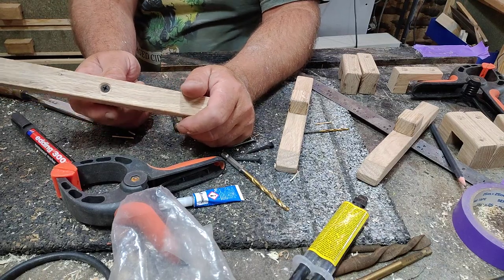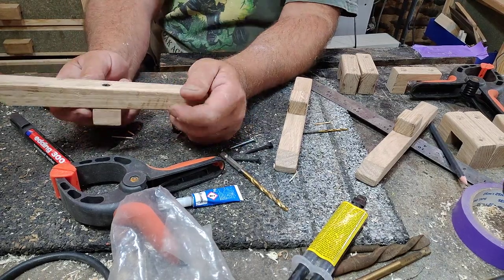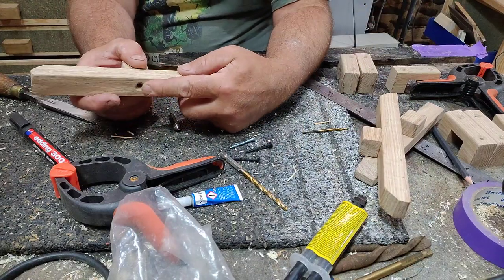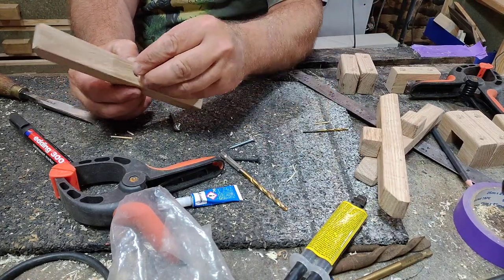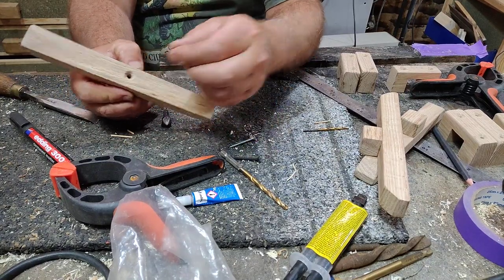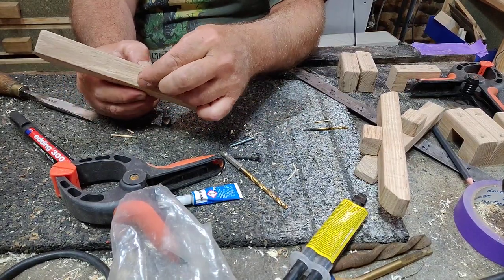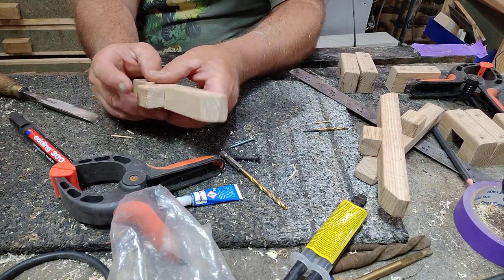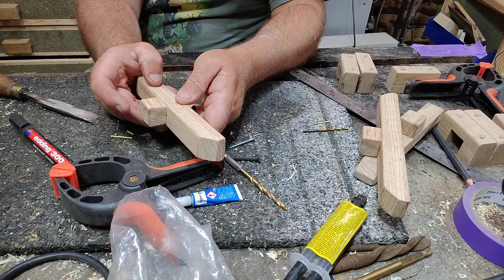The first thing you've got to do is prep up. It's very simple: you've got to create a clearance hole — a hole with a bit of slack so the screw can go in there without any problems. That hole's a little bit on the big side to be fair, but that's your clearance hole. It doesn't go all the way in — it goes in far enough just so you can get a bit of bite into this piece of wood.